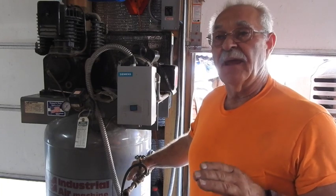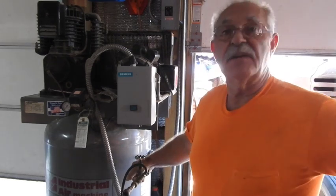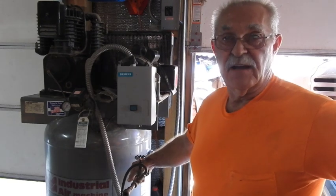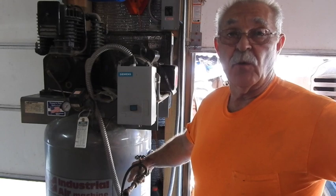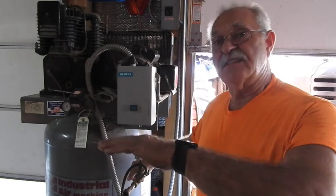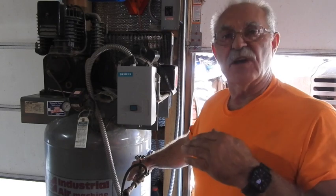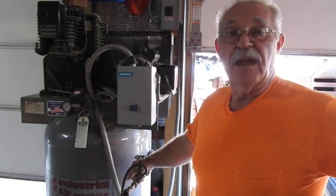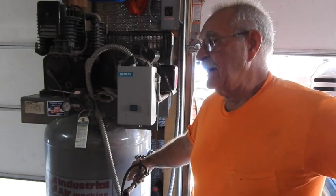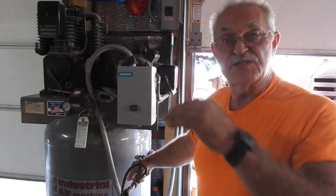There's a calculation that you do, and I've just finished wiring this thing in. I ran 70 foot of conduit and about 70 foot of number 8 wire, because it does draw 21 amps. 21 amps is okay on number 10, but if I'm on a project that makes this thing run continuously, then number 10 might have a tendency to warm up. So we just ran number 8 in one-inch conduit with plenty of room for heat dissipation and to pull it through that distance with only two sweeps.